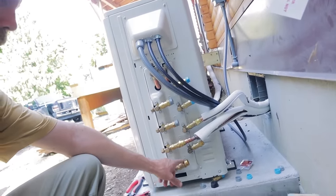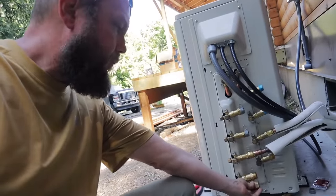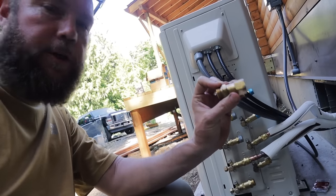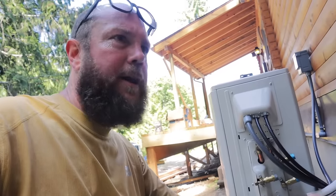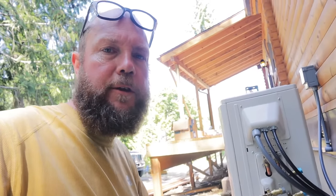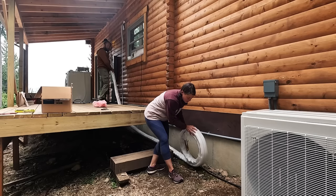these are the new adapters that we put on, and I had to take off these ones here and put these ones on. So these actually come off if you're using, I think the online manual said, if you're using a 24K or 36K, which ours is the 36, with 4 or 5 zones, then one of these does need to be switched out for it to work properly.